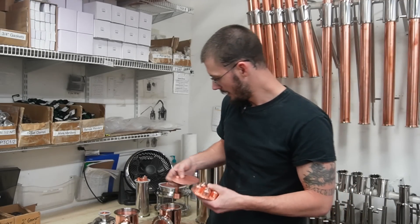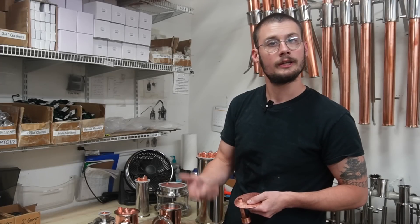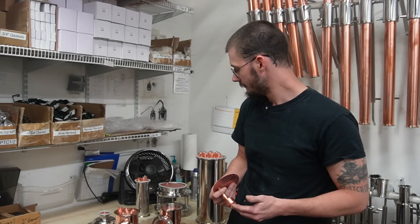If you're thinking about buying a flute or something like it and you're not really sure which plate route you want to go, give us a call. We can do a half-half mix if you want to test it on your side — three downcomers, three bubble plates, whatever you want — and you can really see if you're noticing a difference between those plates and what they're doing. Or get a set of each and run one run downcomer, one run bubble plate. We're going to be explaining a little bit of the differences without running today, and we'll see if we can help you along in your decision-making process.